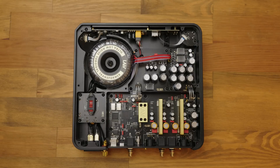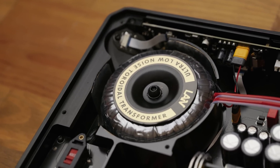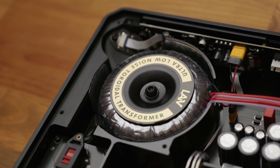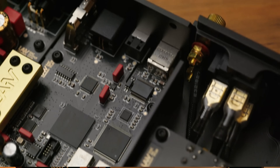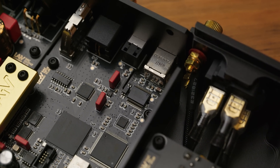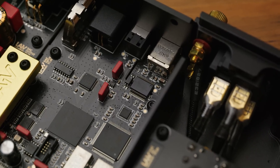Looking inside, we can see a large transformer for the linear power supply with some additional Mu Metal shielding around it, which seems to work quite well — given that at the output, the mains leakage pickup is pushed down to below minus 130 dB. If you'd like to see full measurements of the Harmony DAC, they are available at the audio files section of headphones.com, linked in the description, or click the card at the top. The USB connection is also galvanically isolated, which means you shouldn't need to worry about the quality of the USB source you're using to feed this DAC — you can connect it directly to a desktop PC and that should block any noise that could get through from the source device.